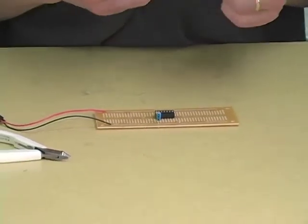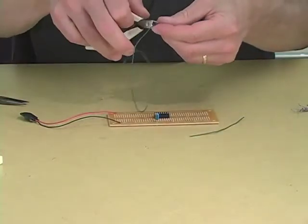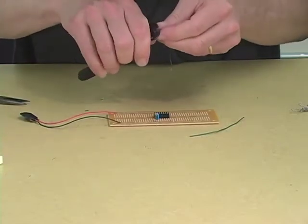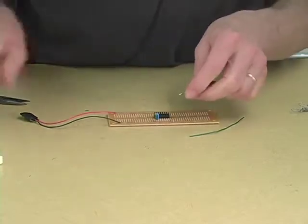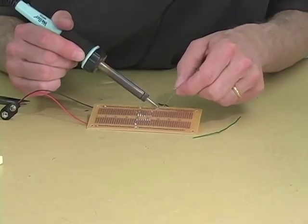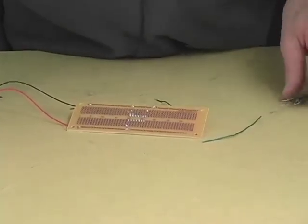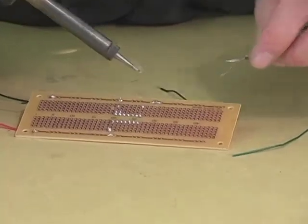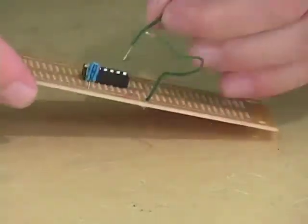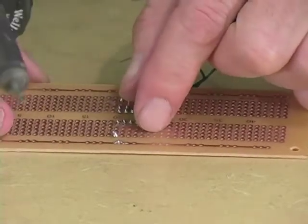All that's missing is connections for our audio. What I'm going to do is make two bits of wire and solder one to the ground and one to the output of the oscillator. For the moment we're just going to make a clip connection to our amp, but later on when we decide how we're going to package our circuit, we can solder the other ends of these wires to whatever kind of jack we decide to use — a mini jack, a quarter-inch plug, whatever wiring standard you feel like using. For now, all we need is a little bare wire.